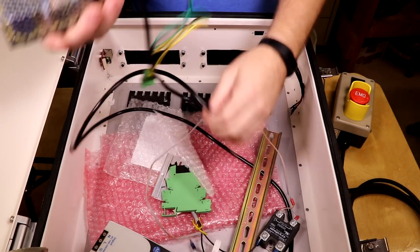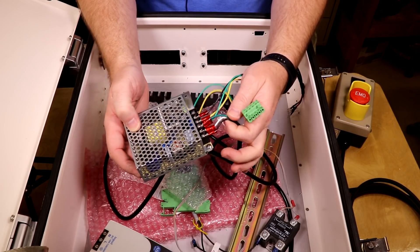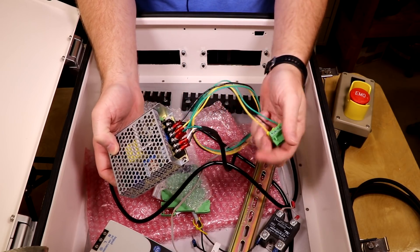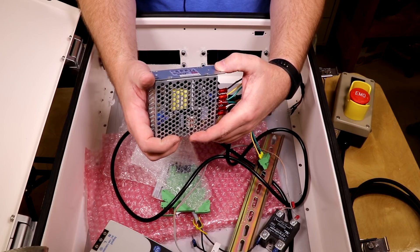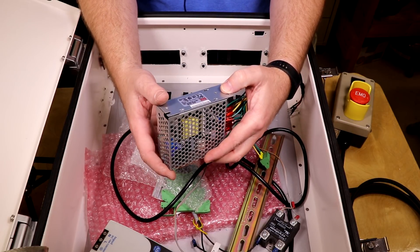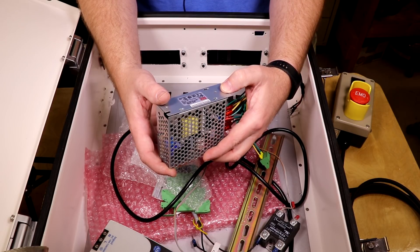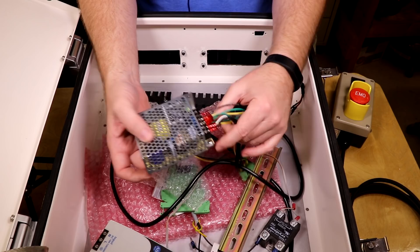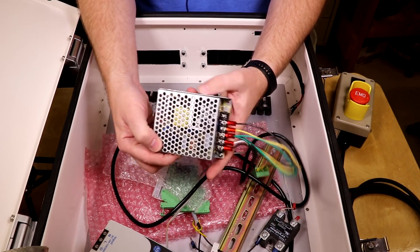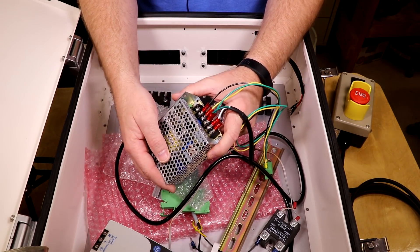The power supply I'm using to run the ClearPath servos you've seen before — it's the one that ran the KR33 version one since inception. It's an eBay find: an Allen Bradley 1606-XLE, and it does 48 to 52 volts at 5 amps, which seemed to work okay so I'm continuing with that. The power supply that came with the Acorn came pre-wired with the input for the Acorn board, a power cord already pigtailed, heat shrink everywhere, and ferrules on the wires. It's a Meanwell RD-35B — it takes 100 to 240V AC at 0.8 amps and gives you 5 volts at 2.2 amps and 24 volts at 1 amp.